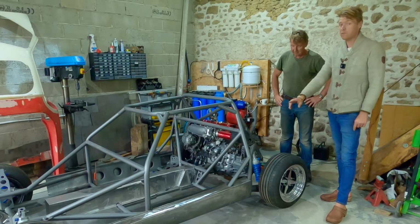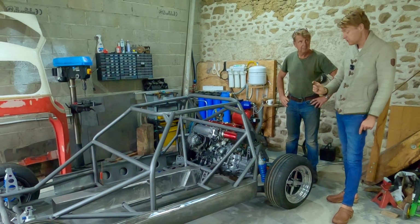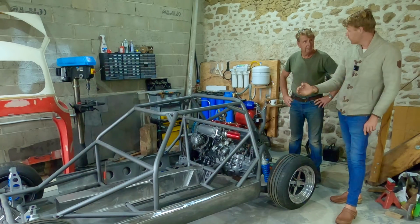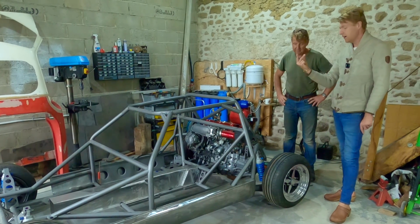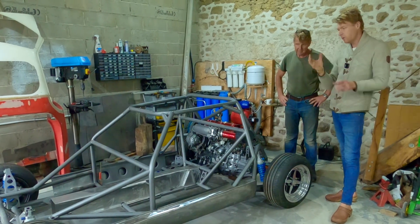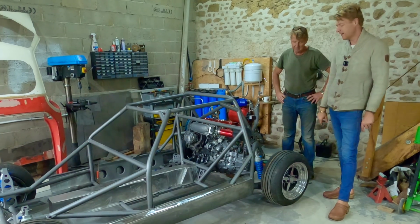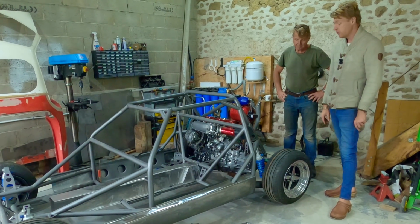And the reason why I went for tubing rather than making a box is a box would have had four welds in it, and it's a very small thing to have four welds in. Then you'd have to smooth out all your welds, because otherwise you can't get your coil-over in. So I said, well, let's just slip a tube over the top.